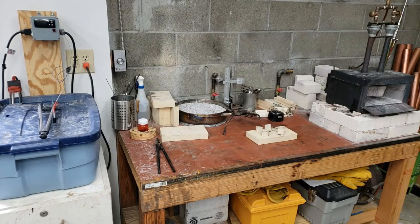The first area I'm going to share with you is my hot work area, or my hot bench. The bench itself is actually a wooden bench but has half-inch terracotta tiles on the surface to protect the wood from flames. When I'm soldering and brazing, I do not work directly on the surface of the terracotta tiles, but rather on top of fire bricks. I have two types: a light fire brick — the white ones you see the actual forge sitting on — and a more tannish, thinner fire brick.